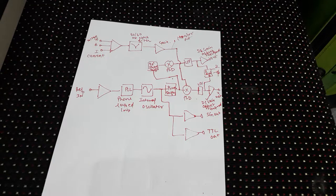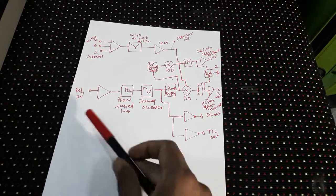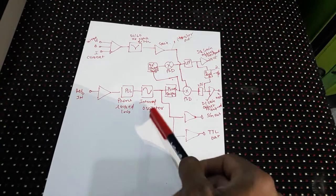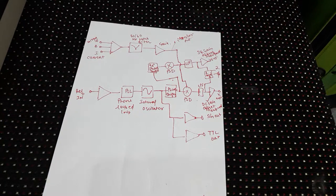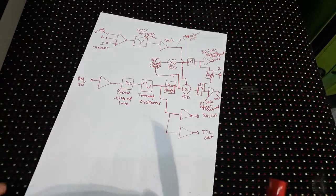The phase-locked loop (PLL) is very important. The internal oscillator locks to the reference, which makes the reference frequency Ωr equal to the signal frequency Ωs, reducing that component to DC. The phase must also remain similar between signal and reference; otherwise you get a component due to phase difference. The PLL takes care of both frequency and phase locking.